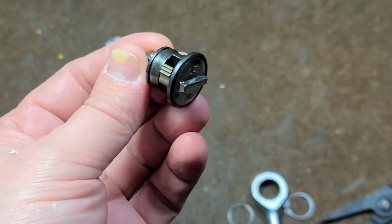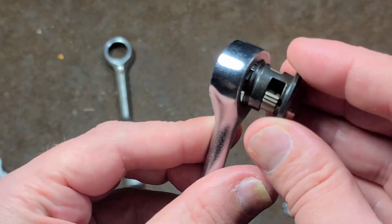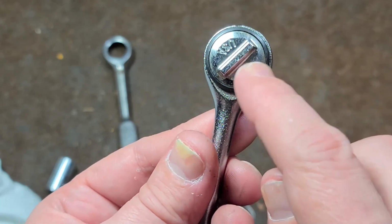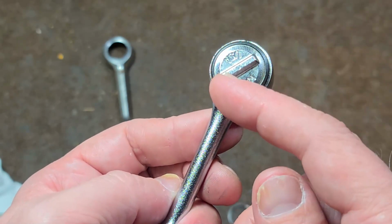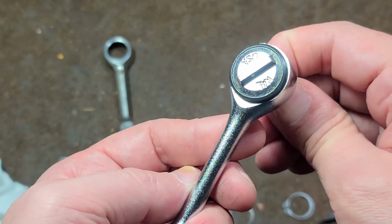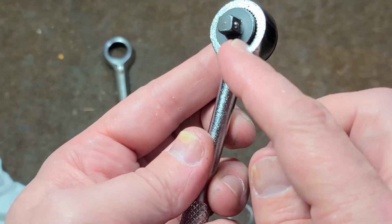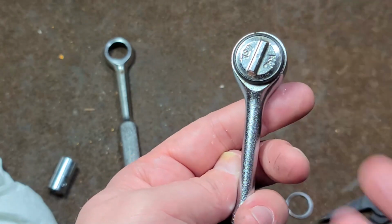Additional force, additional support. Although sometimes that's not always the case, just because some manufacturers choose to instead have a twin pawl design and then have one pawl slightly offset from the other one. That's actually not the case in this KAL, so that you can have some really coarse teeth, say 40 teeth, but since one pawl is offset from the other one, it's kind of like the Gear Wrench 120 XP, where you can get 80 teeth because one pawl only engages at a specific time, and when you turn it, it's lifting up that pawl and riding on the very edge of the teeth, and the second pawl is actually sitting into the groove, effectively doubling the amount of teeth you have versus how many are actually cut into the ratchet head.